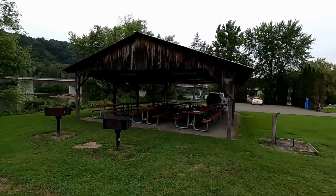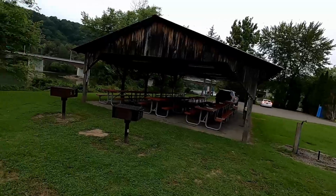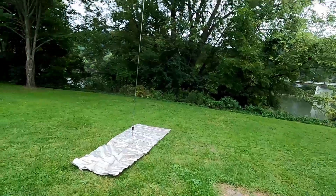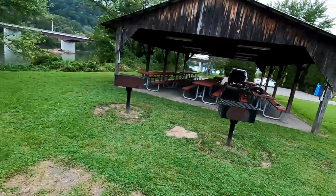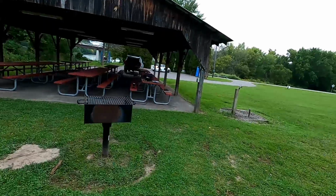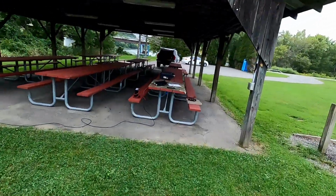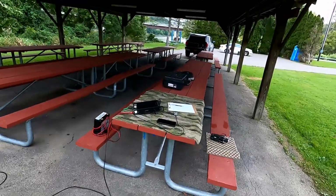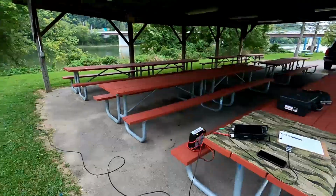I intended to do an activation yesterday at Oakley Corner State Forest. I had my KX2 all packed up, knee board, the whole nine. I was going to hike way out in the woods and do an activation, and I got up and checked propagation, and even on 100 watts I was barely hitting the RBN. My signal to noise ratio reports were horrendous. I had maybe 2 spots, between 6 and 10 dB. It was pretty bad. Today the conditions are better, and I'm not running the KX2.